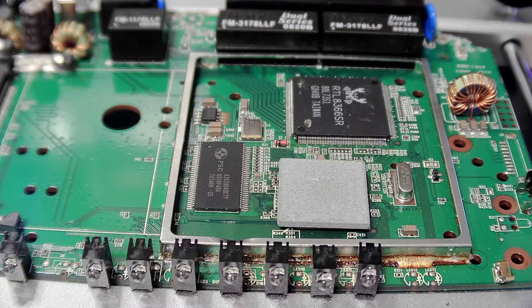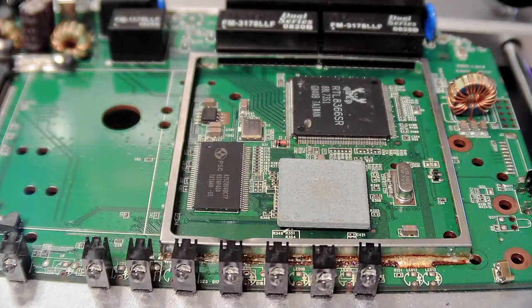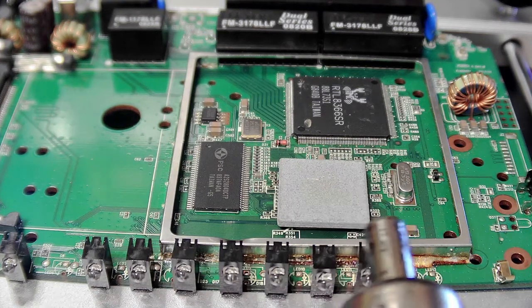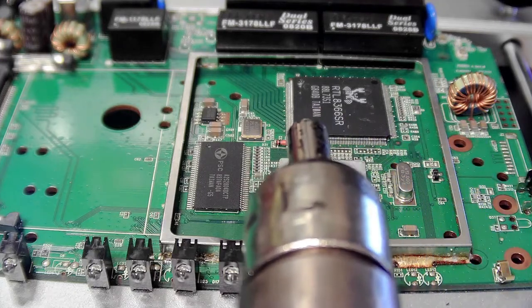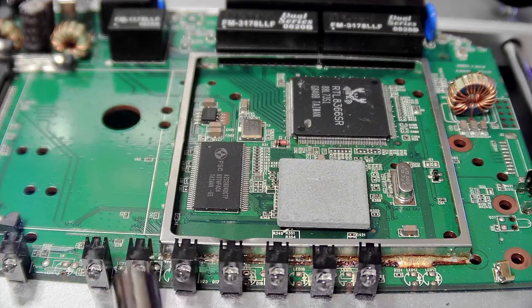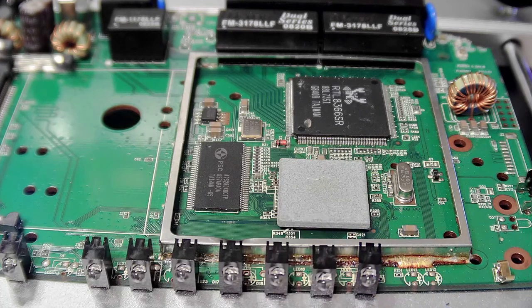So I am suspecting, normally you probably would put some flux on there and hope it goes underneath, but I'm going to try to do it without. And I am going to have to take the hot air gun and aim it at the edges, I think. It is interesting to note that the infrared one, even though it got the chip right up to 220 degrees Celsius or more, I actually tried to touch one of the little components next to it. They weren't actually loose, and these plastic LED bodies over here were not damaged or overheated by it. So I thought that was notable.